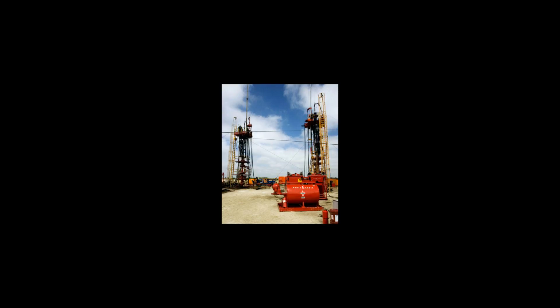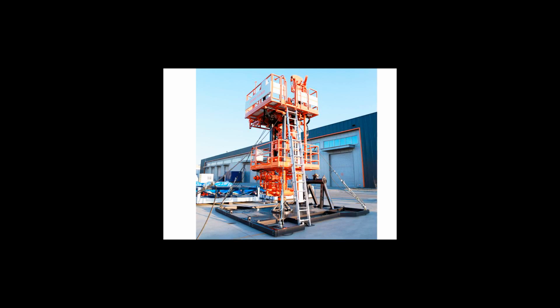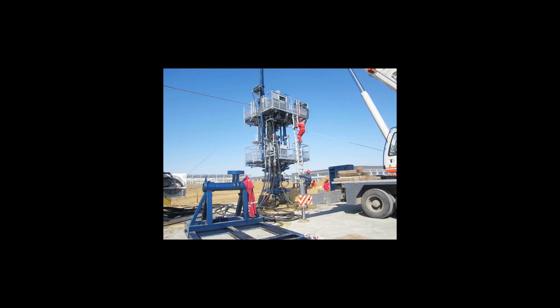Rigup. A snubbing rigup is a very tall structure. It consists of a hydraulically powered snubbing unit, which provides the force on a pipe, above a string of multi-layered pressure control components. At the top of the snubbing unit is the basket, which serves as the control post for the rigup. Below the basket are the hydraulic jacks, which power the pipe into and out of the hole.